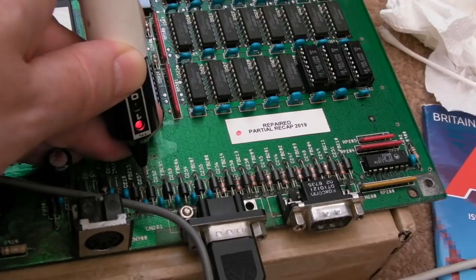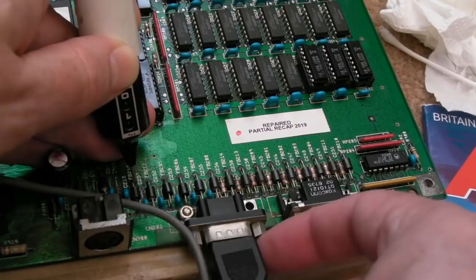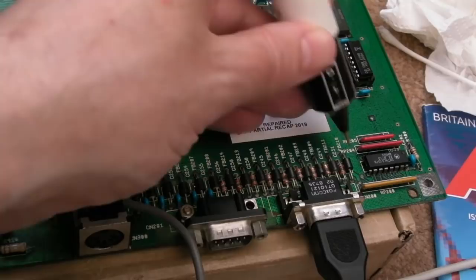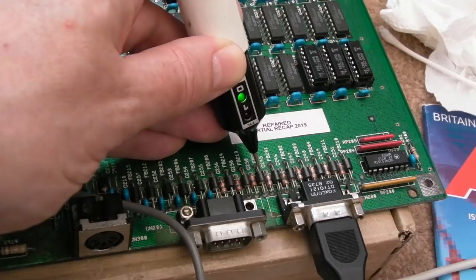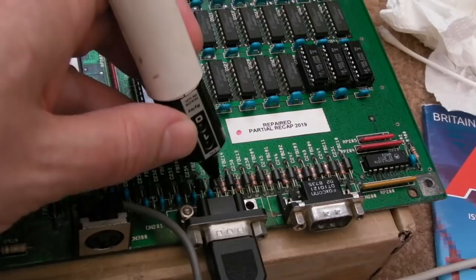Maybe that's the other button. Let's just put that there, just to see if we can work that out. No, it's not. We've got no highs here though, have we? Ah, there's the other button. So it would appear the buttons are high and then go low. But it would appear the other inputs don't work that way, certainly on this board. Let's check these caps here.